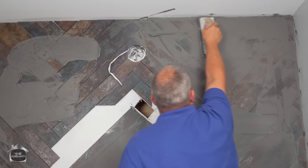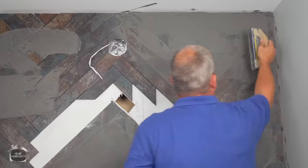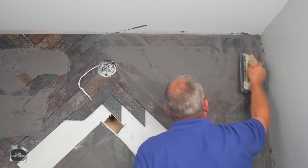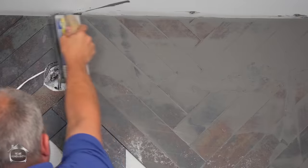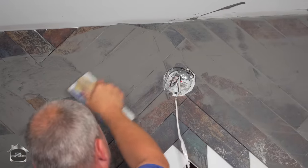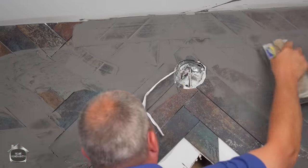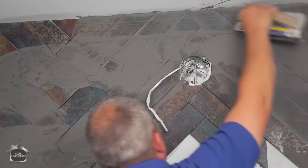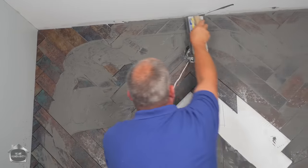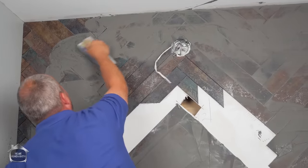Now I'm gonna finish off at my ceiling with the concave part of the float. The goal here is to leave a little bit of grout filling that gap. And then I'm gonna use a translucent silicone or clear at the top so that you don't have an ugly silicone line. There we go. So you really want to make sure you fill all the little gaps up there